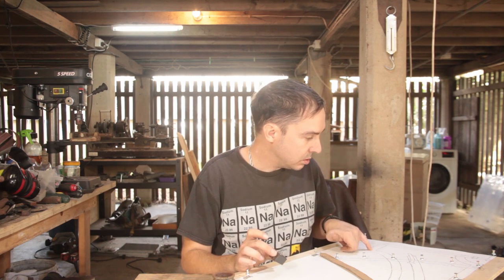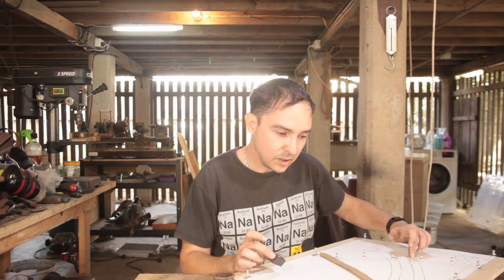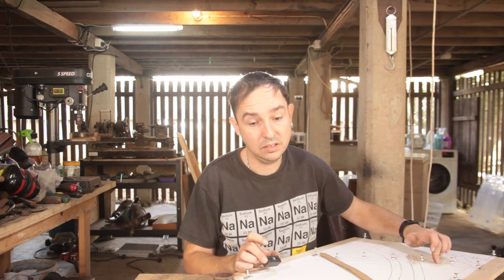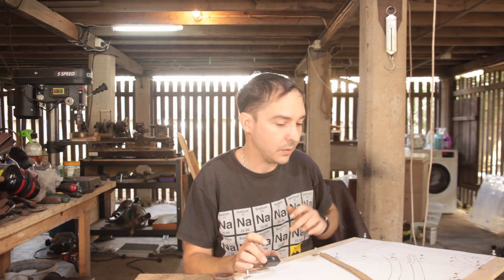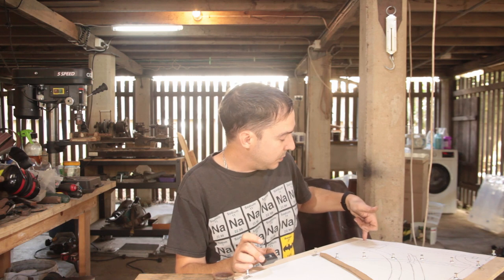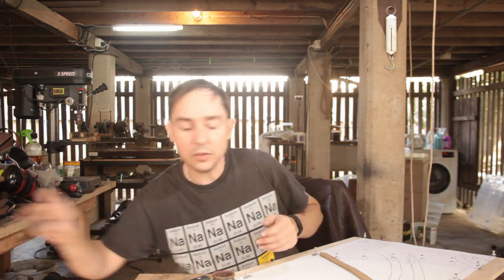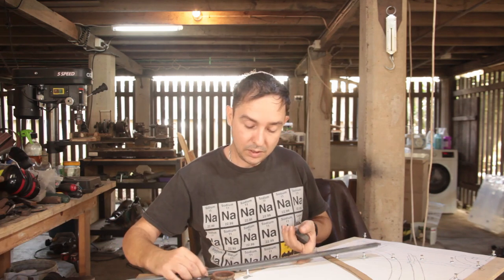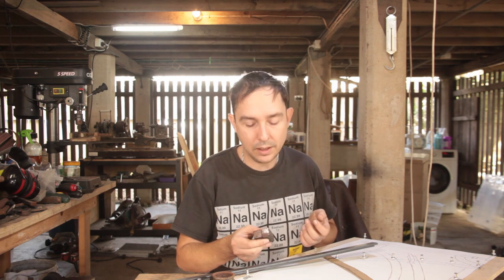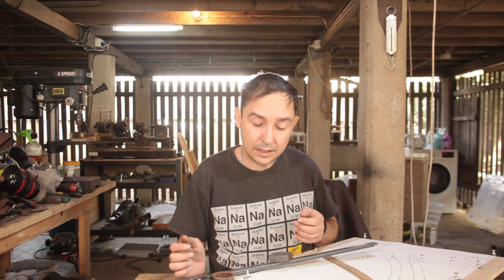I'm using 10 by 25 stock for the structural pieces. The vertical is a piece of 20 by 20 solid. The lifting arm will be 6 by 25, as will the sector arm. The collar will be probably 10 by 3 — I think I've got some of that around somewhere. If not, there'll be a trip to the steel yard. To make the spring swages I'm just using mild steel, because under this application it'll last more than long enough. I've got some hardy shank material cut up — this fits my antique anvil but doesn't fit my modern anvil, so I'll probably end up forging these down a little bit just to get that fit.